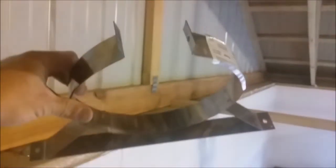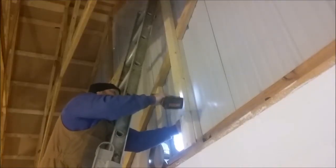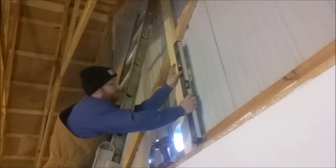What I'm gonna do is take this board right here next to it and put wood screws in — screws in this board and all the way up that one, all the way to the top on both sides. When you go to put this bracket on the outside, it'll mount right to the two-by-fours when you go to screw it in — you'll hit a two-by-four all the way through there; it'll be real strong. And there it is — the two boards going all the way to the top.